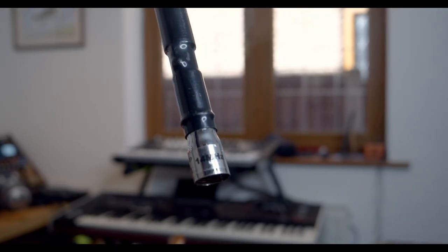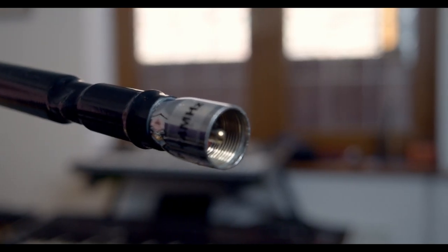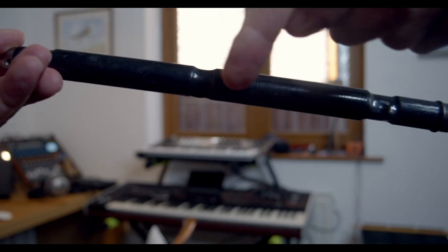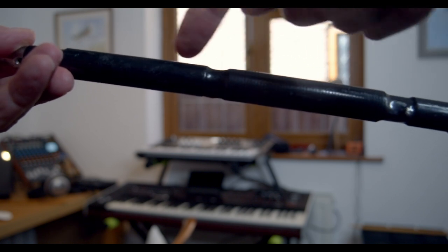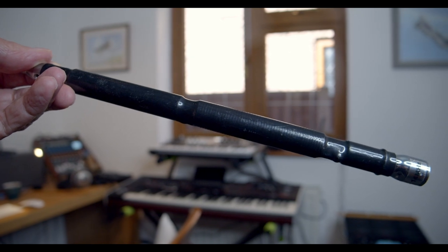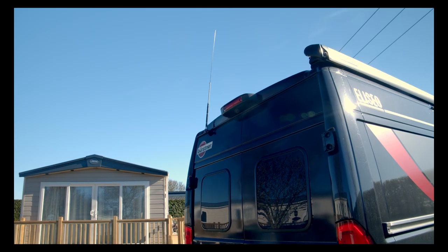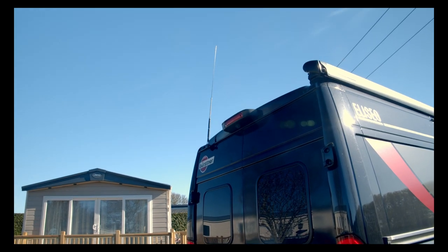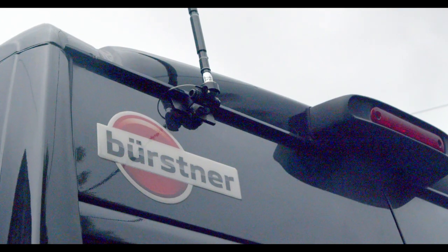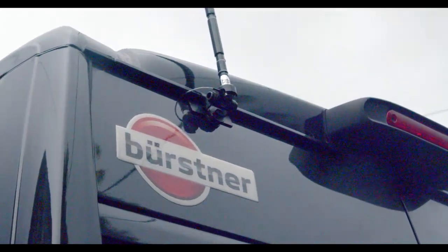The base of the antenna is very well made, and if you turn it round you can see it's a PL259 fitting. The winding is quite interesting — if you take a close look you'll see it's divided into two sections, which I think is to avoid self resonance. The total length of the winding is approximately 26 centimetres. Here you can see the antenna mounted on top of my motorhome — it makes quite a neat installation, but I don't drive with it. I only use it as a portable or static mobile antenna.